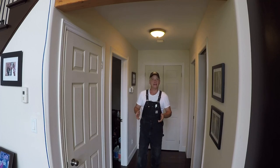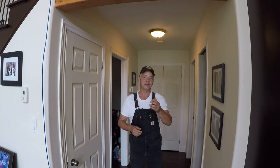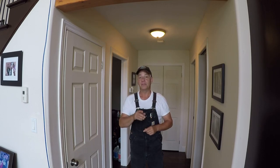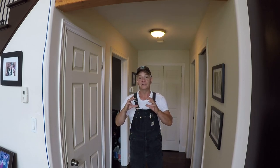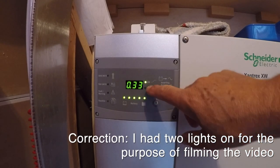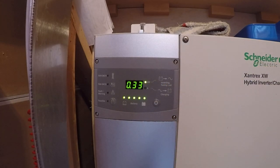You want to add that 500 watts for what they call a phantom load — also called vampire loads, or what I call mystery loads. You don't think you're using anything in the home, but you've got a lot of stuff plugged in and many devices will still leak or use little bits of electricity. Combined, you'll end up with a meaningful load. On my solar system I have a meter that tells me how much load is being consumed at any given second — and even with nothing turned on in the home right now, I'm currently drawing 330 watts of power. That's why I suggest adding about 500 watts to whatever your total is, just to capture that phantom load.